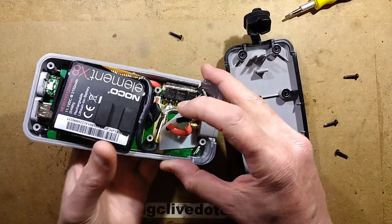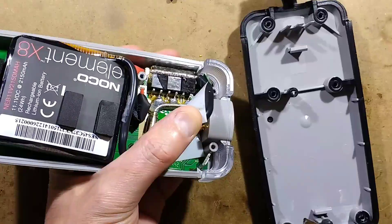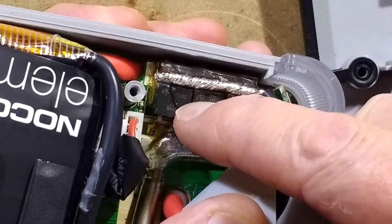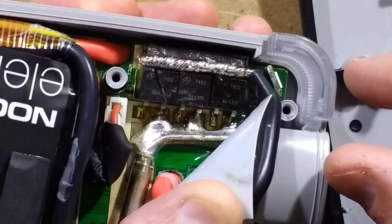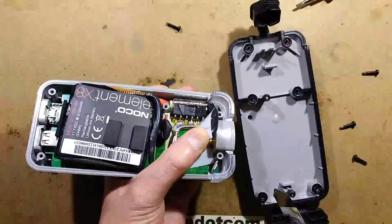Right, that might be the problem. Let's see if you can actually see this — I'll zoom in. This is cracked. This thing has seen a bit of current and the heat has actually caused diode failure. Let's zoom back out then and investigate this further.